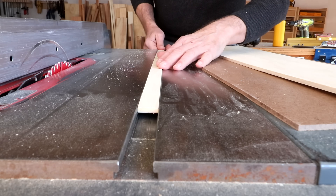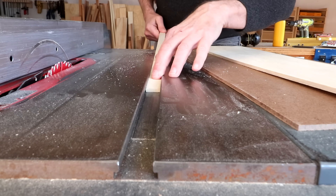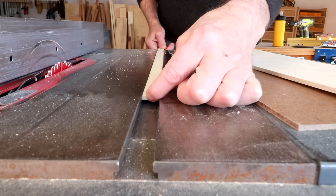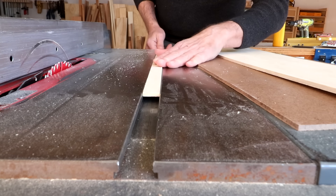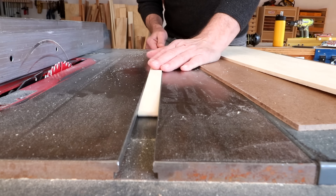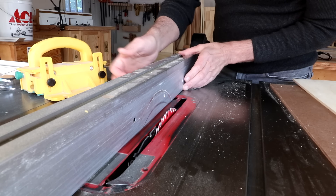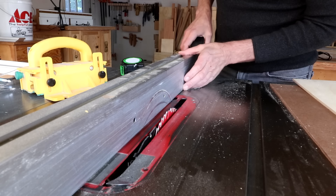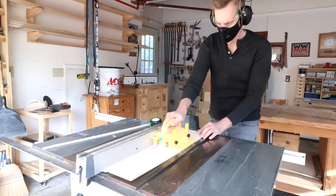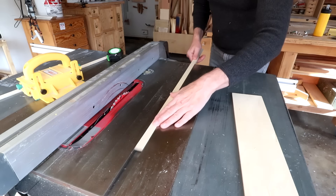This is the fit I've got right here. If you have one of these T-tracks, you don't want it to go all the way down where it might drop in, because when using this sled it's actually going to be flush with the top. It feels like I could go a little bit looser — I'm going to slide it over just a hair. Yeah, that's a lot better.